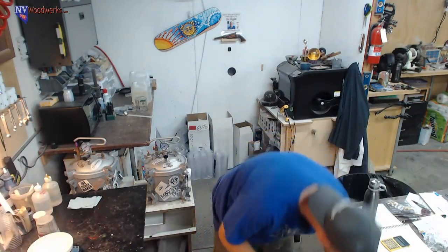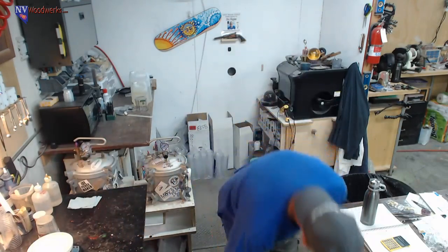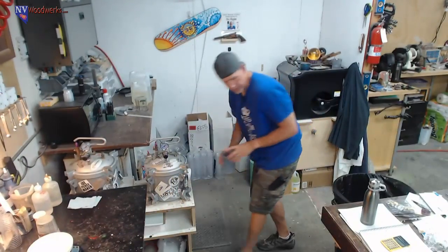I did check to see that it fits in the pot. That is actually a really good thing to bring up. Make sure, especially if you're doing something you've never done before, or you made a mold that you have never used before. I made a mold, I call this a six pen blank mold. I made one out of 3/4-inch material and it didn't fit in the pressure pot after I was done because it was not 1/2-inch. So the dimensions, adding an extra 1/4-inch on each side, made it to the point where it wouldn't fit. And I actually had to round over the corners just to get it to fit in my pot. So before you use a mold, make sure that you know how it's going to go when you put it in there and that it'll fit and all that kind of stuff. Very good thing to bring up.